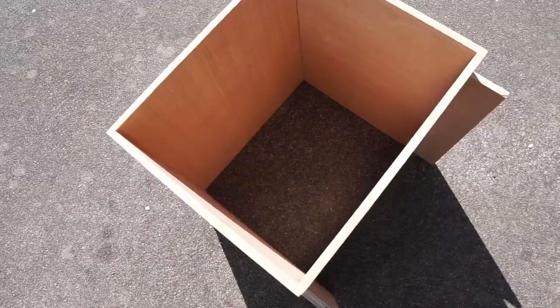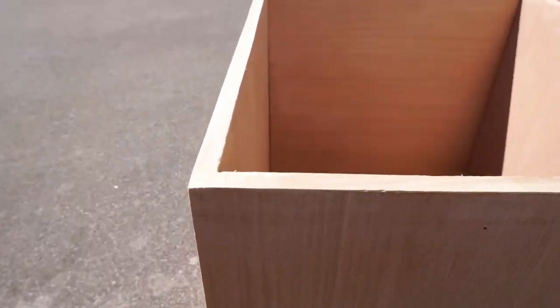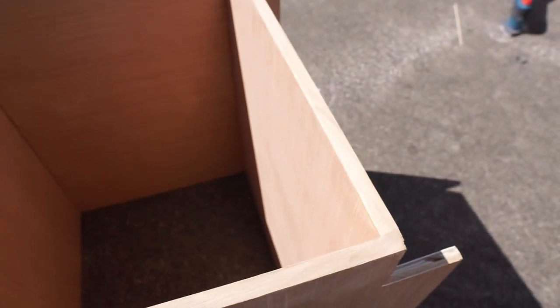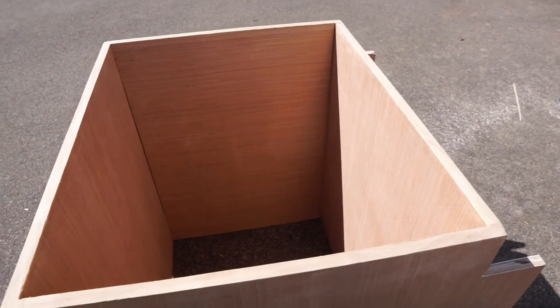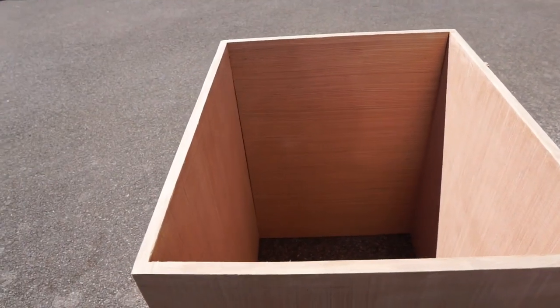Handy little tool, that. I don't know whether it's a bit too bright to be honest, but the veneer is on, and I think it looks pretty good actually. Definitely no voids from the plywood, so once it's all painted up, I think it'll be pretty good. I went over with some 240 grit sandpaper just to make it nice and smooth, just being careful not to go through the veneer because it is pretty thin. I'll quickly show you the cabinets.